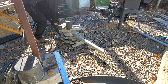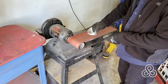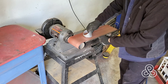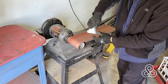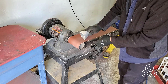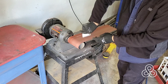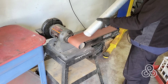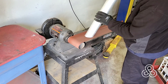Once we got these things all cut up, as with all aluminum welding, the magic is in getting it perfectly clean. So we're going to take it into the sander, bevel it, take off all the burrs, and put a little bevel on there so that we get a little bit of penetration on those welds. Aluminum is very particular — the oxidation wants to float on the puddle of metal. If you get too much oxidation, that puddle will tend to push and form a gap or a hole in your weld. So as much oxidation crud as you can clean off these things, the better for the weld.